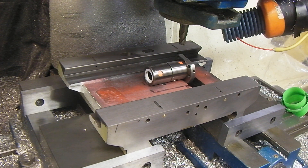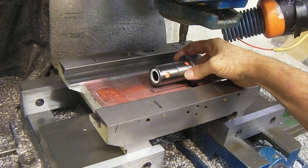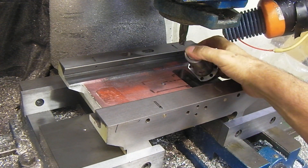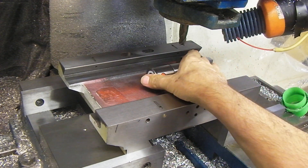The pocket — the nut almost fits underneath the table, so you really only need to take like 50 thousandths off. To give a little bit of play, I'm going to go .14 inches deep and the slot is 3 inches long and basically 1 inch wide. Most of the units these days are all going to be double nuts and it'll just sit in there like that, and the flange goes down inside the hole, which I actually like — the mounting of the way the X ball nut fits on these real well.